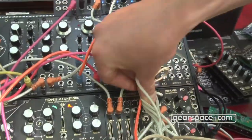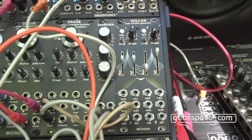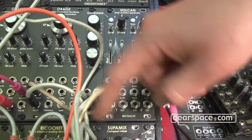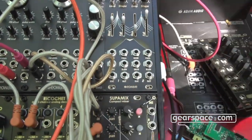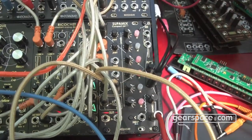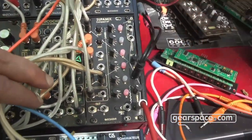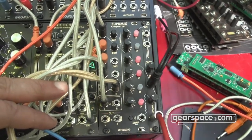The second one I'm going to show you is a Super Mix — a really compact stereo mixer made mostly for 7U cases, because you need space to mix things but sometimes you want to pan things or have stereo inputs. You have six voices: you can pan two manually and two by CV, because you don't often need to pan everything by CV. There are two stereo inputs since there are a lot of stereo modules right now. There is also a header on the back to link this to our new headphone/line-out module so you can have a master volume.